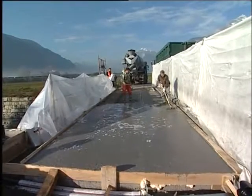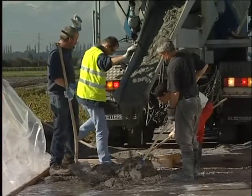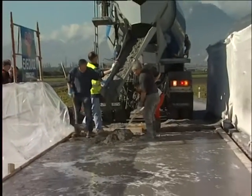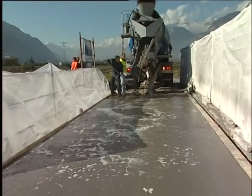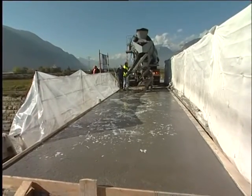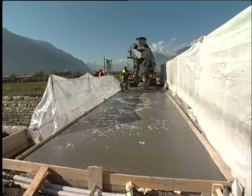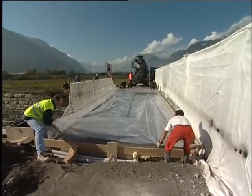After nine batches in the plant and three deliveries on site, the casting of the UHPFRC overlay on the downstream side of the bridge deck was terminated as planned before midday. The use of high-performance materials does not exempt from applying suitable curing — on the contrary. UHPFRC is very prone to self-desiccation at early age and requires moist curing of eight days to develop the full potential of its excellent properties.